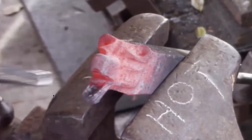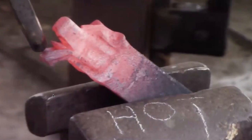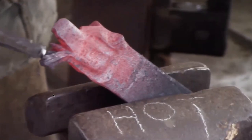And if you're going to peel it out as I'm doing there towards the front, then you can get it. Try not to have the material slip back into the jaw of the mouth. It's a lot harder to deal with. So I'm angling my chisel. I'm in the mouth pushing the teeth out rather than outside of the mouth pushing the teeth in. See, I'm peeling it off. I'm moving my chisel out to the outside of the mouth, trying to bring that material out to the outside.